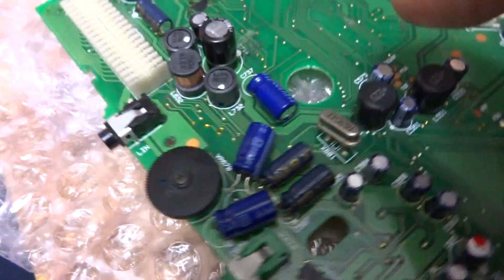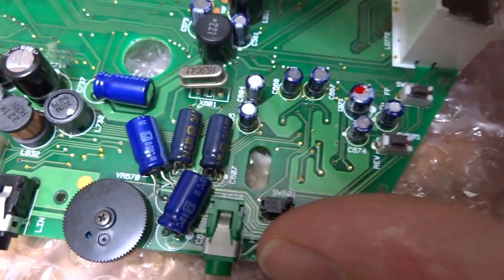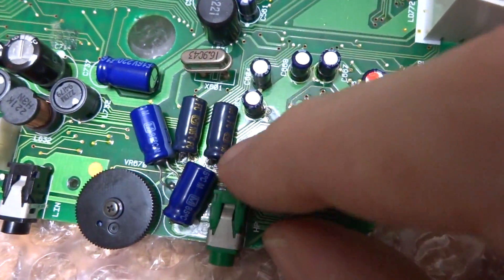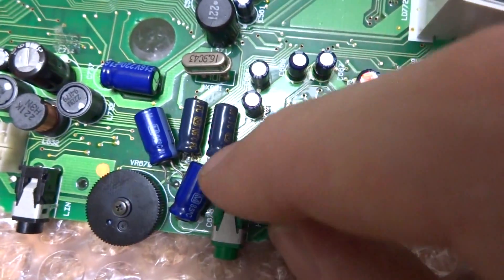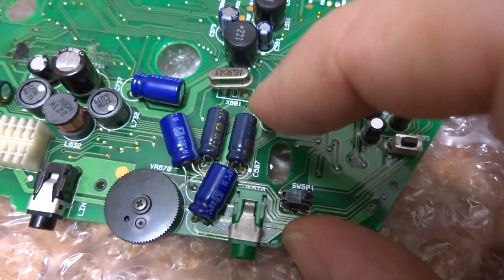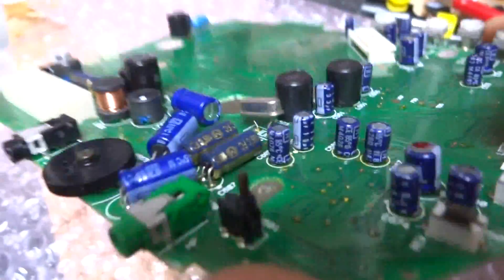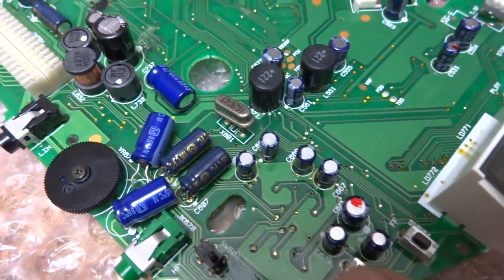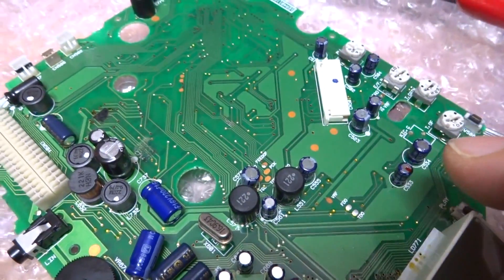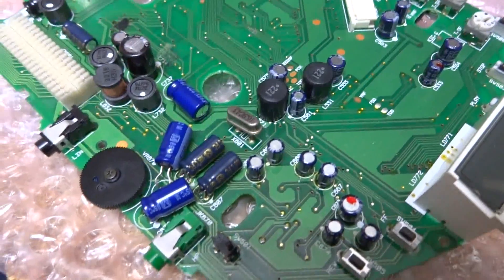I got these four in — I had to put these two on their sides and angle these two, especially the top one off to the left and this one a little bit to the right. I had to make sure there was enough clearance between the top of one cap and the bottom of the other, because the negatives are on the right — the left leg is positive and the top of the cap is negative. You really don't want those touching unless you want sparks or a fire, so I made sure there was clearance.